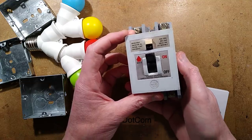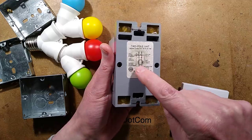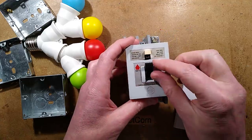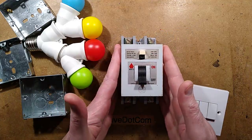It's not really marked residual current device — it may be pre-dating that term — but it uses a sense coil around the live and neutral to trigger a tripping device if it detects a difference. This one used to protect this house; it used to feed an old Wylex fuse board.